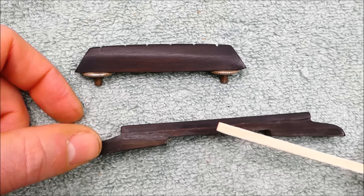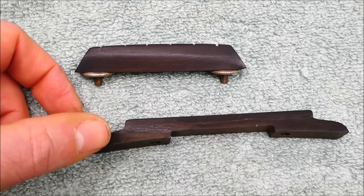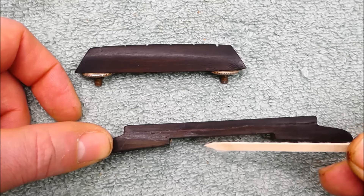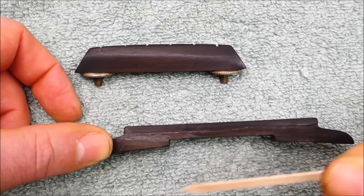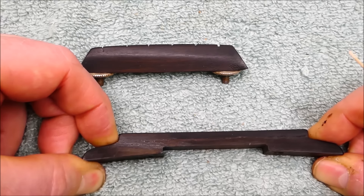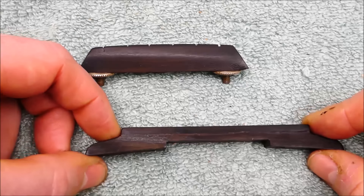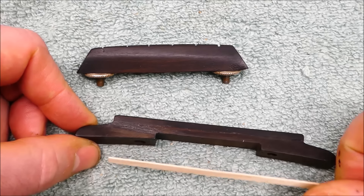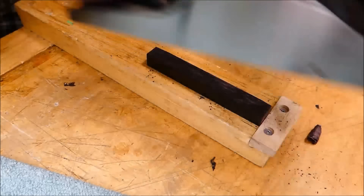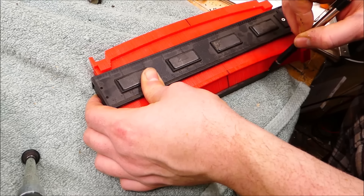For the replacement, rather than have that right angle again, I'm going to borrow a piece of design from some Gibson and Epiphone bridges I've worked on and make that space an arc or portion of a radius, which doesn't focus all the strain in any one place — it gets transferred around. I think this bridge may have been designed to be weak and deflect right off the bat, just so they wouldn't have to go to all the trouble of fitting the feet really precisely to the soundboard arching. That's fine when the guitar is new, but with the deforming that comes with age, it just goes too far. I'm using a big old plastic profile gauge — very handy — to transfer the arch and save some time.